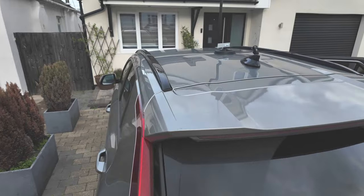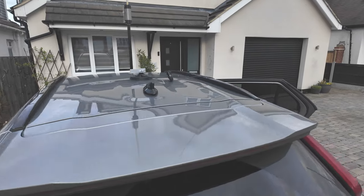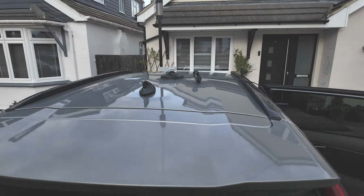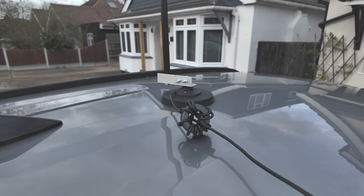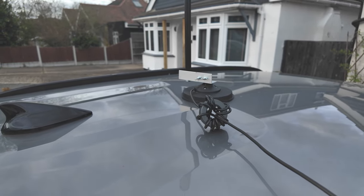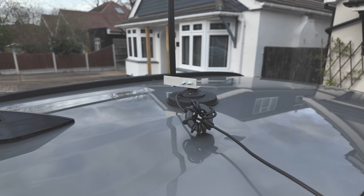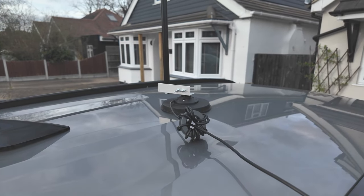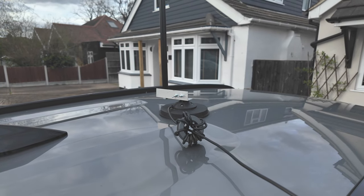So that's the installation and it does the job. It makes good use of what is actually a portable antenna. But with the bracket I've made, it becomes more versatile. And of course on the bracket I've got some terminals for adding radials. Radials don't work much on a vehicle — if you've got it mounted on a vehicle you don't find there's much benefit. But if this is mounted on a different system then it's much easier to put radials on with those screwed terminals. So that's the installation and it seems to work quite well — good VSWR about 1.3 to 1.4 at resonance.